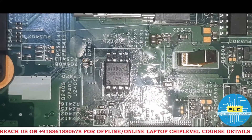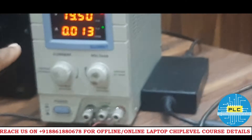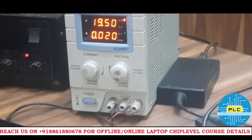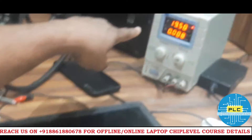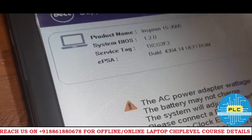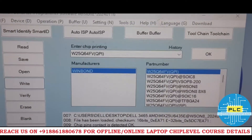The chip is Winbond 25Q64FW. Now in live mode, I'm going to power it on. There's a connector issue — now focusing on the DC machine. There's no CMOS so it should start automatically. Removing and reinserting once more. It started! See the display — it's working! The display is confirmed. This is purely a 1.8V Winbond chip written using 3.3V software mode.